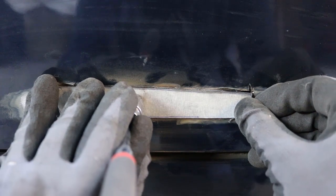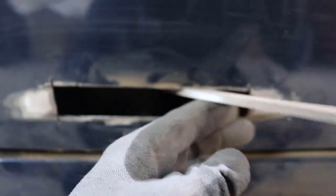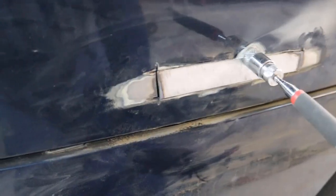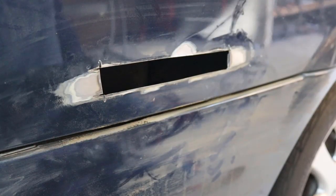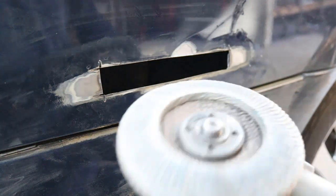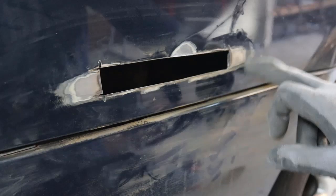I'm just offering it up here — it's a pretty good fit. It needs a little bit of filing off the top edge just to get it to be a perfect fit. Now it fits really nice. I've got the flap disc in the grinder and I'm going to grind about an inch around the edge just to give a good area to weld to.